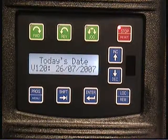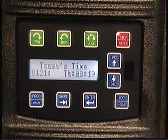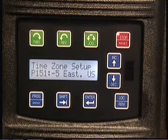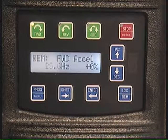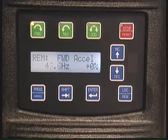The X5 has a real time clock that allows you to set the hour, minute, day, week, month, and year. This functionality allows for controlled enabling of the drive, provides maintenance reminders, allows data logging, and vastly empowers the program sequencer.